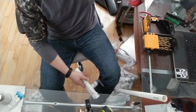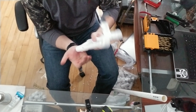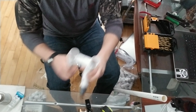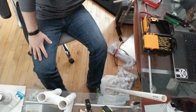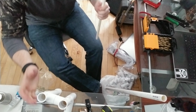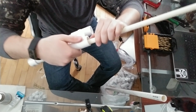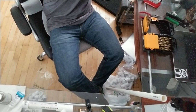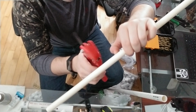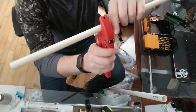And 3. Go ahead and clear your pipe out. Alright, so now this part's all set to go. So now we need basically the siphon portion of this, right? So how I do this, I don't use a measurement. I just stick it all the way down to the bottom. I take my finger, I mark it, and then take my PVC cutters. This is that 1/2-inch CPVC, and I go about 1/4 inch below my thumb.